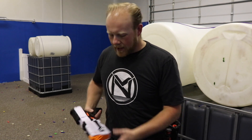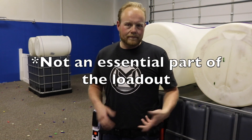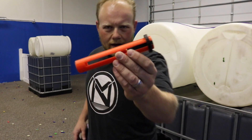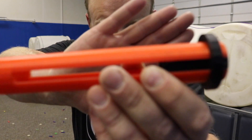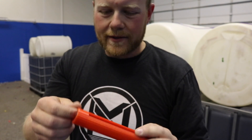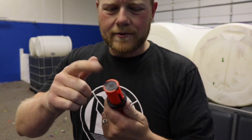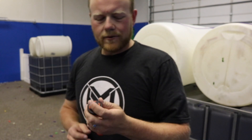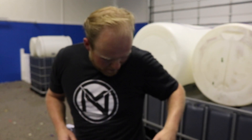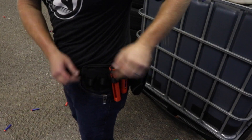You don't need something really elaborate or fancy. The only reason I have the holster is so I can use this with something else, or at least give me a place to put it while I'm talking between rounds or when I'm reloaded. The speed loaders themselves — they worked, but they were just a first file. It took a lot of modifications to get them working the way I wanted: I had to trim a little on the inside so rounds would come through easier, and I had to change the top cap because it didn't fit right. A lot more work than I anticipated, but being able to print as many as I needed was the selling feature.